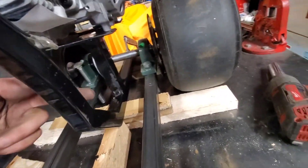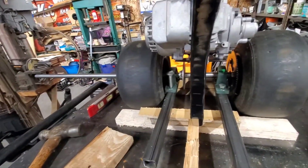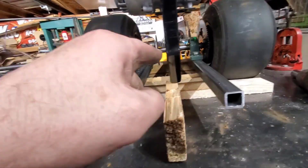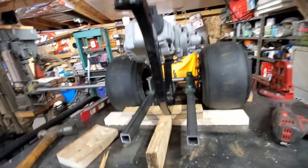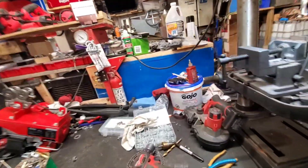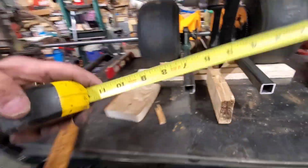I don't think I'm going to be able to cut and notch it at a 45 like I wanted here. But maybe I can — maybe I can make a 45 over here on the floor, measure it, stick it in, 45 it from there back, and run another brace across the back. The frame I'm going to keep going right out the back. There's a lot of measuring — you gotta measure. The space here needs to be seven and a quarter, and the back's gotta be seven and a quarter too because those bearings flip around.